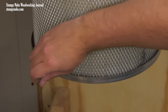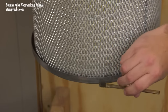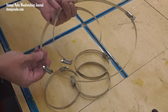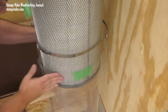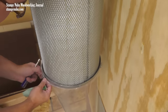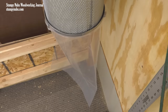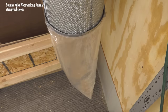Finally, a collection bag must be attached to the bottom of the filter. Before I installed it, I brushed contact cement around the rim and let it fully dry — this will really help prevent slippage. Then I combined three large hose clamps together to make a belt to hold the bag in place. I'm using some 4-mil poly bags from Wynn because they're just the right size and fit the filters really well. You may use any heavy-duty bag you wish, but keep in mind the length of the bag will determine how high the filter must be mounted from the floor. You may need to raise everything up if you want a larger bag and you might run out of ceiling space. If you do use a large bag, I recommend letting the bottom rest on something just in case it gets too heavy and pulls the bag off your filter.